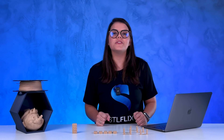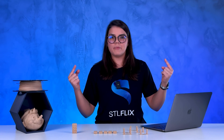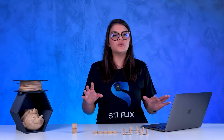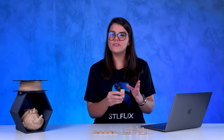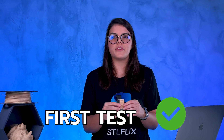There's a bunch of ready-to-print files for testing there, like this one I'm going to show you. Starting with temperature — regular PLA has a printing temperature of 190 to 230 degrees, and the wood PLA was between 170 and 200. This was the first thing I noticed I had to change. It looked quite flawed at the sides, but the best result was 180 degrees, so that's what I'm going with.